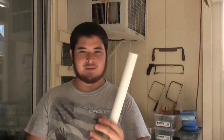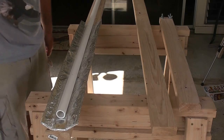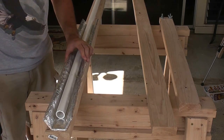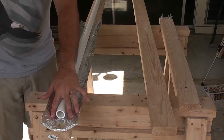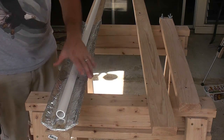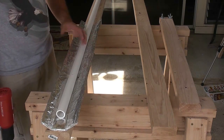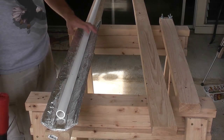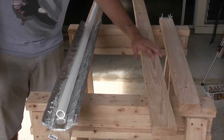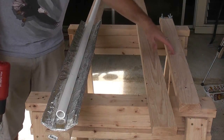The first thing we're going to do is heat this up and flatten out the limbs. I've got my heating trough here, which as I explained in the last video, is basically just a piece of cardboard folded to make a gutter and then lined with aluminum foil. This is just to help reflect heat back to the plastic, and this will heat up a lot more efficiently. Then I've got my flattening board here, so once this is heated up enough, I'm going to transfer this over here and flatten it.